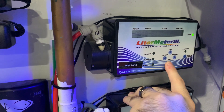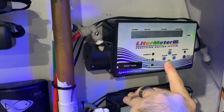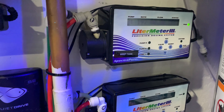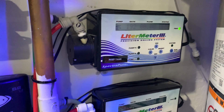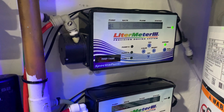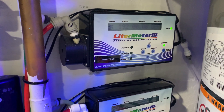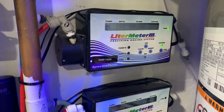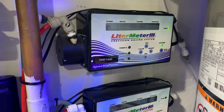So if I want pump B to also do 1.5, I would put it on 1.5 and put that to run. And what it will do is it will do an auto water change. How that works is it goes pump A, pump B, pump C every 192 seconds throughout the whole entire day. And that flow is based off of a daily 24-hour flow rate.